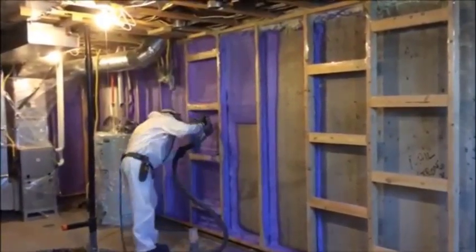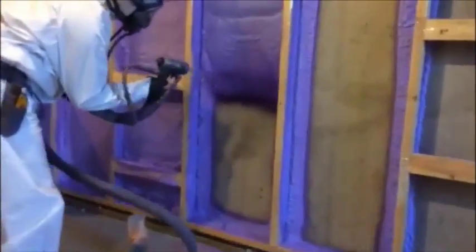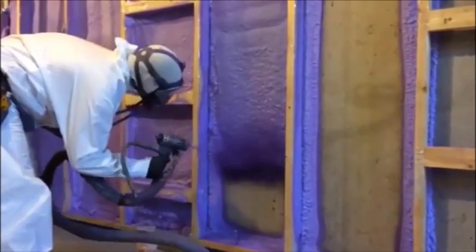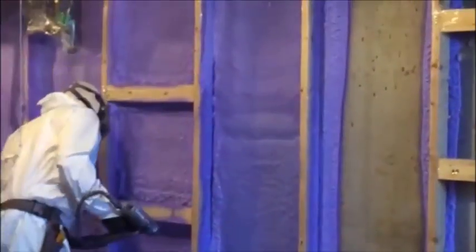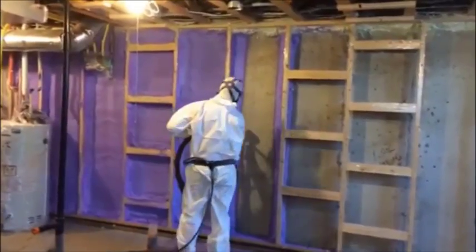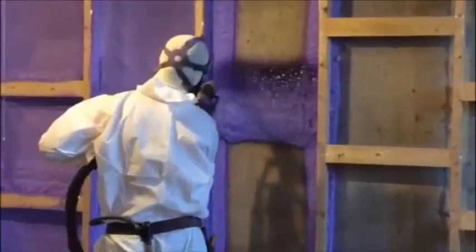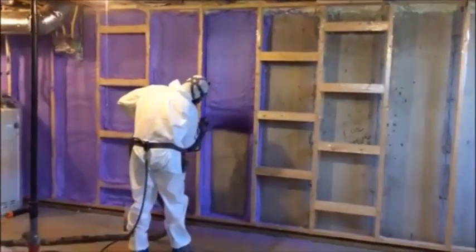That's why he's going in and detailing it out side to side. This particular wall has no electrical on it because the homeowners don't want any plugs. This framing was set out by the builder two to two and a half inches away, making allowances for it to be batted. Homeowners switched — once they bought the home, they decided they wanted spray foam. That's okay; we'll just get a thicker amount of foam behind the studs and it will work.